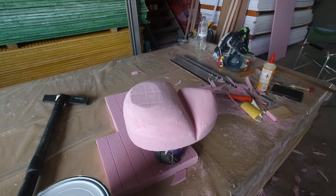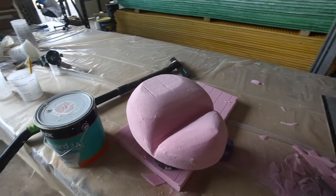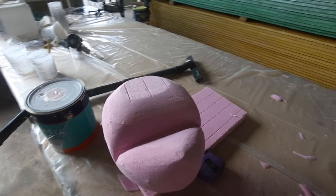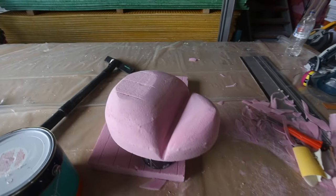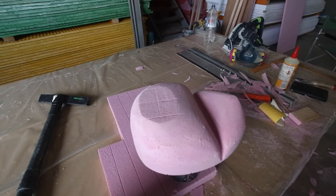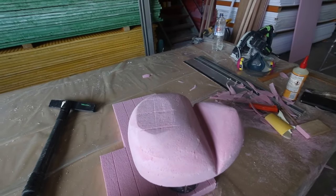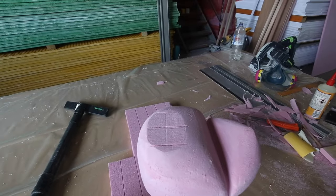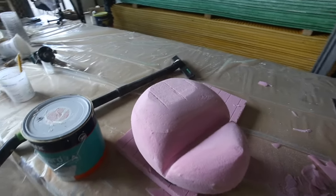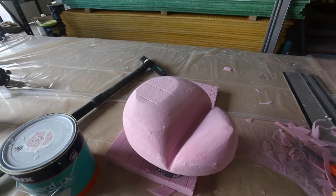Rather than buying a toilet for the pod, I've decided to make one myself. So I'm using the separator type toilet, where the solids are separated from the liquids, which is supposed to then let the solids compost with very little smell. There's quite a few toilets like this on the market, and all reports are they work very well, but they're fairly simple. It's just a bucket basically with a fan to draw the air out away from the living areas, and you empty it out when it's full. And rather than buying one, which is $1,000+, I've decided to make one.